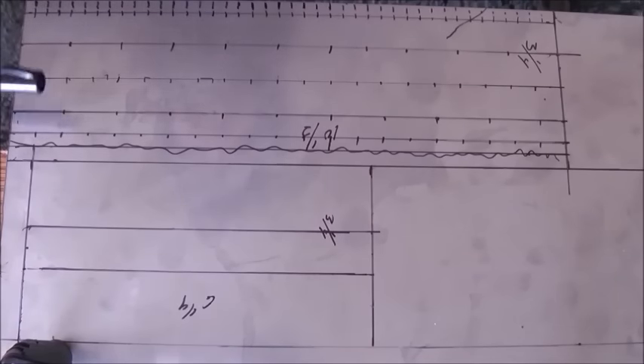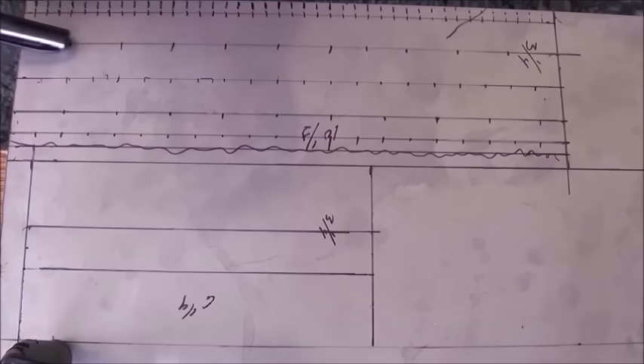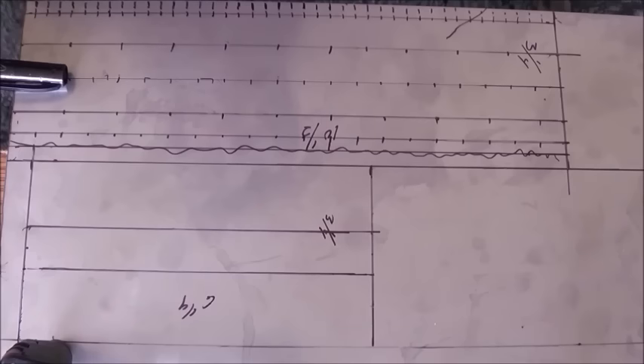You've just watched me make most of my measurements and marks here on our combustion chamber — this is the main outer wall. We have a mark about a quarter inch from the leading edge, which will be the compressor side. We're going to have the tightest hole group here — every quarter inch we're going to drill a hole; they're going to be really small holes. The next line down has one inch spacings between each hole, then back to a half inch spacing at our center line.